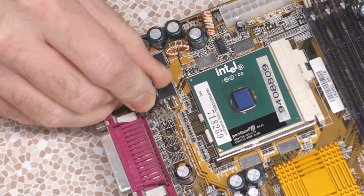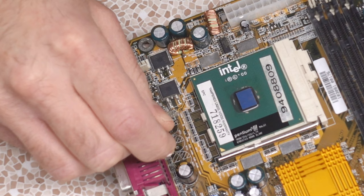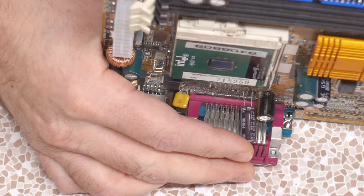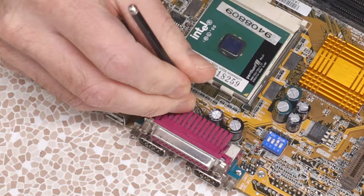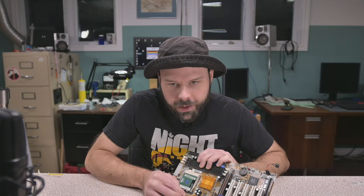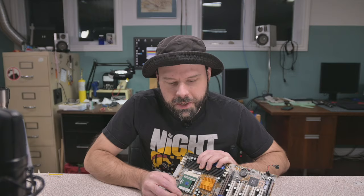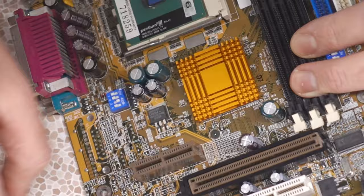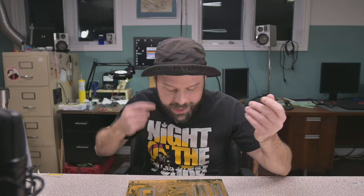On the front side of the board, we're clearly labeled positive and negative. Positive is the empty space, negative is the full space. The holes I cleared out are not quite big enough and these capacitors are slightly different shapes, so they're not quite fitting. Oh, that went in nicely — I'm just going to prick out these holes a bit to widen them. Big money, let's do this. These capacitors could be better implemented somewhere else in my inventory — I'm going to put them on this board and then never actually use this board. They're all in place now.